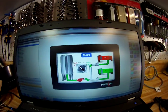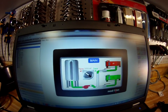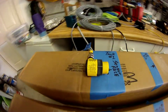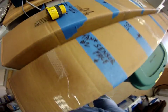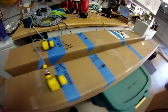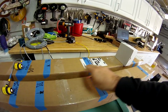We're going to demonstrate today a simple application using the Red Lion G304 Cadet HMI out to a Banner gateway which has a couple of analog sensors connected to it — T30 ultrasonics. We're going to have two tanks, tank 1 and tank 2. We have two sensors connected to this gateway, and the goal of this application is to measure the level of the tanks and set some set points within the zone.